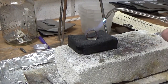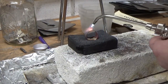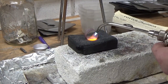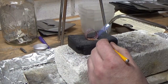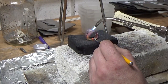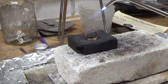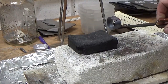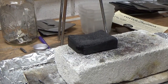Notice I'm really primarily keeping the heat on top until it really starts to turn pink, then I work my way all the way around. You want to heat up the top part first — it'll draw the silver up towards the top. This is hard solder, which means it's going to have to get hot, so be careful that you don't melt it. Once we've got some flow, I just want to make sure it's going right where I need it to go, backing the torch off as soon as it gets up to temp. I like to use my pick every now and then to slide the solder around a little bit and make sure it sucks in really good.